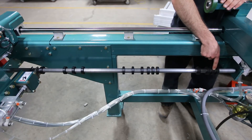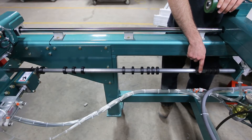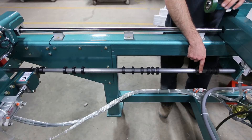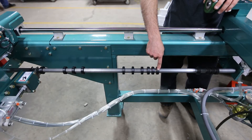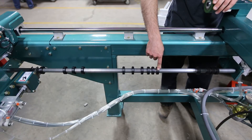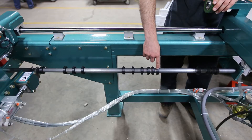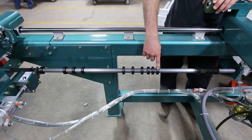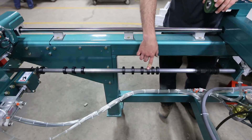Moving in an inch on each side, you get your 34 and your 32 inch. This is an extra for additional settings. Then we have this set up for 12-inch side lights with a one-inch middle jam. So from here we go 13 inches out — that would be for your 32 plus a side light, 34 plus a side light, and 36 plus a side light.